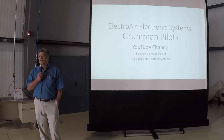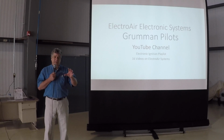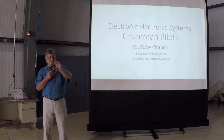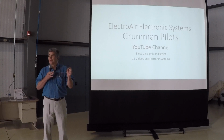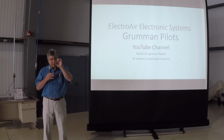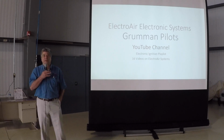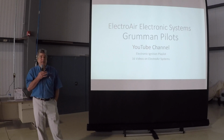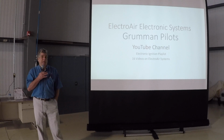Right, and what SureFly did, they did a redesign just this last year. I was talking to one of their engineers, because what they had was a unit that was their 20 degree advance, their 22, their 23, their 24, their 25, their 27, and they decided to consolidate that design and put in a dip switch under a cover, so you can have one mag, one module, open it up, set it to whatever you need. It made certification easier, so each unit doesn't have to be certified, they're going for the one common solution. And again, like I say, the article says they're working really hard for Oshkosh, but that's the same thing they said last year. So it'd be nice to see what happens when you have some competition in the marketplace.